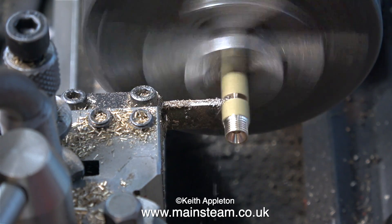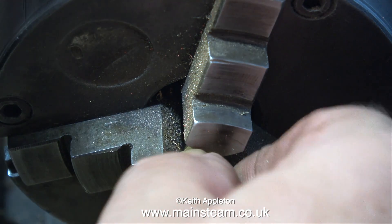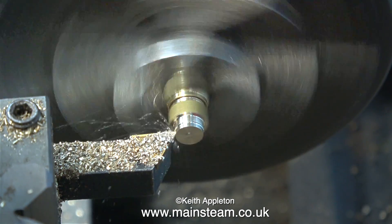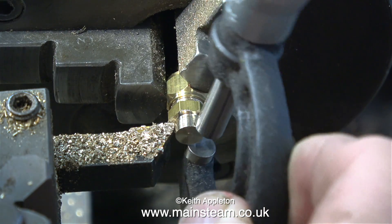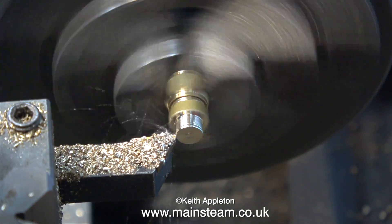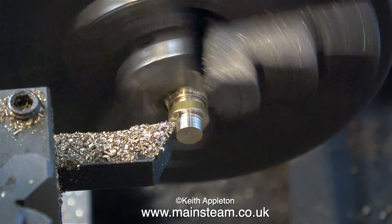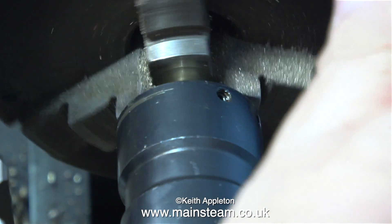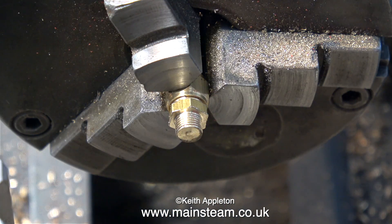I can let it fall into the chip tray because I've cleaned it out. Now I need to cut a thread on the other end which will be 1/4 by 40 threads per inch, so I'm screwing the 5/16 part of the work into a nut and holding the nut in the chuck. For a threading operation on the other end, it's no good holding it by the thread I've just cut because it would just rotate and damage the thread. Also, if I hold it by the hexagon part, that will get marked by the chuck jaws. Over the years I've turned so many pieces of bar down to quarter of an inch in diameter I can almost do it blindfold — but I will insert a health and safety warning: it's not a good idea to use a lathe while wearing a blindfold.